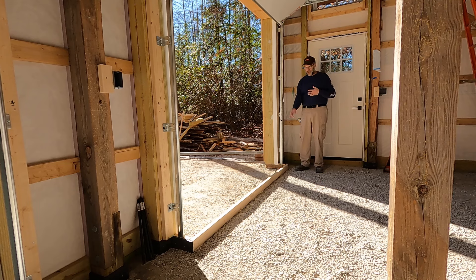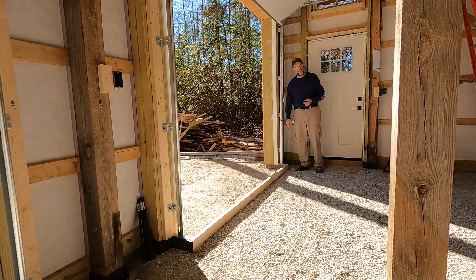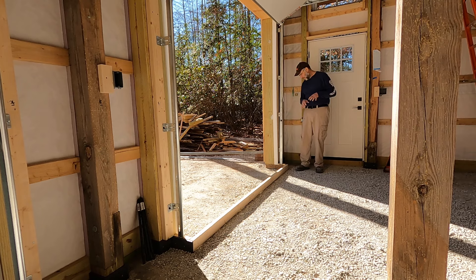So this is going to be done in two different pours. I've got the form laid out to come in from the wall about 10 inches and then go across, which will basically allow a cutout for the apron to be put in in the next pour, probably a week or two from now. This cutout lets the garage door come down and gives me a three-quarter inch higher elevation for my interior floor than the apron. That will let us do the floor and the apron in two different pours with the optimal concrete mix for each pour and get the right grade and drop.